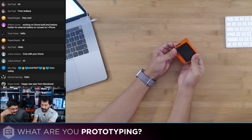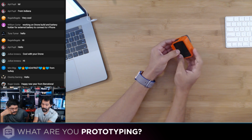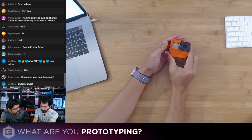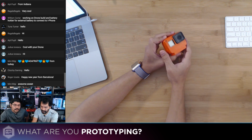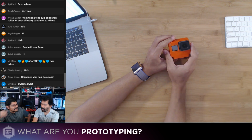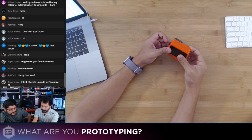Yeah. So now I just popped this whole camera body out, because the SD card is now housed on the inside for waterproofing. This is designed for Ninjaflex, where tolerances are really key. Your tolerances are really tight, so this would not work with regular PLA, for example. Some people were asking if we could redo the design for PLA. I don't think it would work like that. It really wouldn't. You'd have to adjust the sizing and kind of do a different approach. You might need a latch or something.